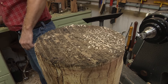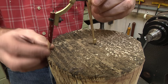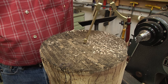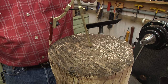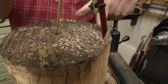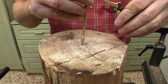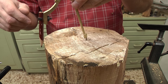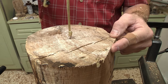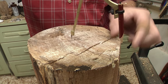There's our center point, and I have my calipers. I'm going to move this out to the very edge and check. We're following the edge right. We're flat spotting there, so we're coming back here. All I'm going to lose here - if I don't change my center point - is only an eighth of an inch of diameter, which is not bad. Let's look at the other end now. I've got big gaps here, so that's telling me I need to move this about an eighth of an inch.